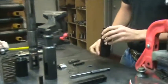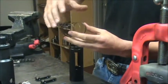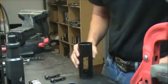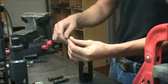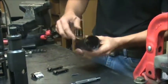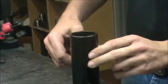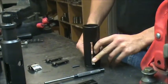Now I take my dog retainer and dog spring. Always check, make sure it's a good spring. People have problems with these crisscrossing a lot. Go on to the side — some of the other sides you have to go on to the top, but this particular side you go on to the side. Got a little piece of flat metal — you can take a hacksaw blade or whatever. Make sure the tail end of the spring doesn't end up in the window. You want it to end up there. Always compress your spring to the threads. Take your metal and get it to stick.